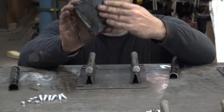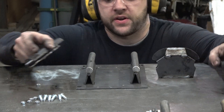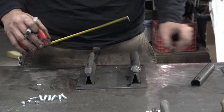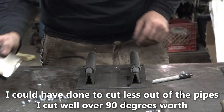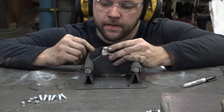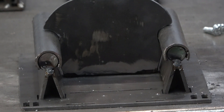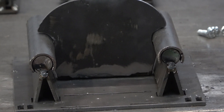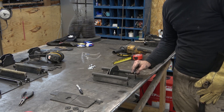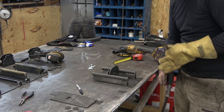Now we've got our crusher piece — the big, flat, open face faces down. If you've got spatter, this is the time to clean that off. What we're going to do is take our two opened pipe sections, measure up from the bottom four and a half inches, and make yourself a mark. Those marks are where the bottom face of your can crusher needs to line up. There's only about a tenth of an inch tolerance inside of here — this needs to be a relatively tight fit. Make sure your pipes are sitting evenly on the 3/4-inch rod runners, not skewed left or right. With that all positioned nicely, you want the pipe even with the bottom of the rod on both sides, those marks lined up. Just put in a good tack right here and right here to hold the two together for the time being.